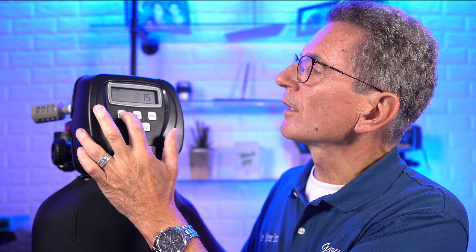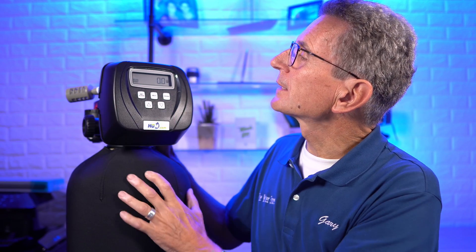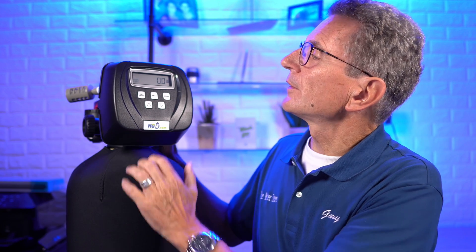If you have an extended power failure of 45 minutes or longer, reset the time using set clock for the hour and set clock for the minutes. There are a couple of normal operating screens when you're in service mode. The current time is shown, but you can also press next to see the flow rate — we don't connect a flow meter to these air over media iron and sulfur filters so that will always show zero. Press next again and it tells you the days remaining before the next regeneration. Press next and you're back to the current time. You can see 'regen today' flashing on the left side of the screen, telling us that at 1 a.m. tonight it's going to go through a full regeneration cycle.